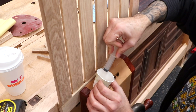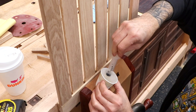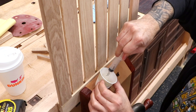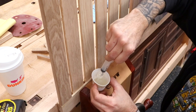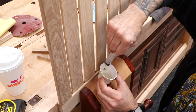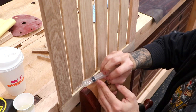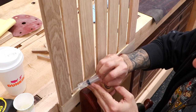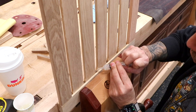What I'm gonna do is take some epoxy and backfill. It's really gonna do two things: it's gonna prevent this from being a place for water to settle, and it's also gonna seep in and around these slats to help further stabilize them. I've got an irrigation syringe — the kind your dentist sends you home with after wisdom teeth removal to clean out the hole. I'm just gonna squeeze some of that in. This is what I call Precision Epoxy Pour.